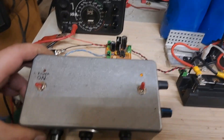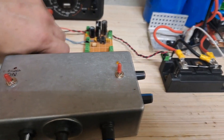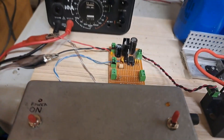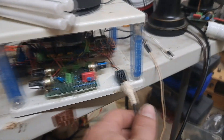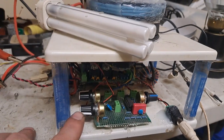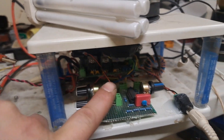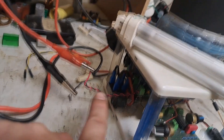I've got the ramp circuit in here now — pretty much the same setup but with its own battery. Basically I've got the output feeding the gate driver for the buck, then I've got the other enable output which is bootlegged on and travels through an opto-isolator — that's my enable input, basically the interrupter input for this Tesla coil. This coil was made to be a ramp setup; I've kind of been playing around with it over time.